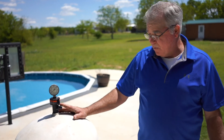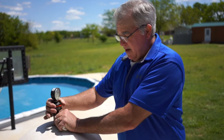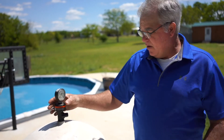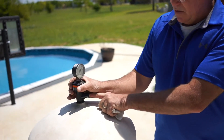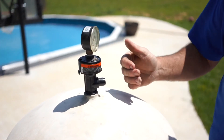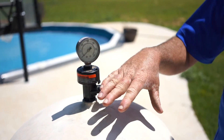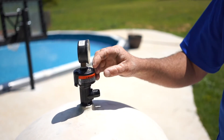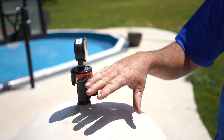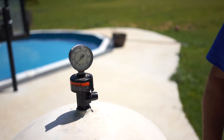It's simple — turn everything off so there's no power. Once the pump is off there's no pressure on the tank. You can loosen the air relief valve. Yours may have a different style, but this Pentair one you just twist it and it will release. There's no pressure on it if the pump is off, but it'll be filled with water, so there's vacuum pressure. We want to release that vacuum seal. Once you open it you'll hear it hiss as all the water drains back out of the filter. Wait until it stops making noise.